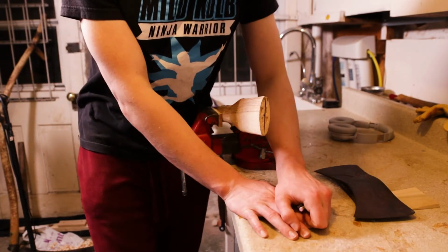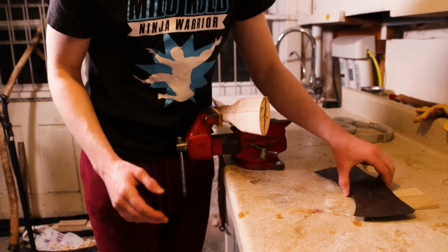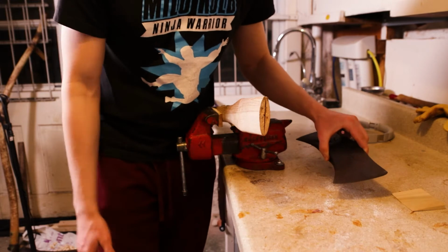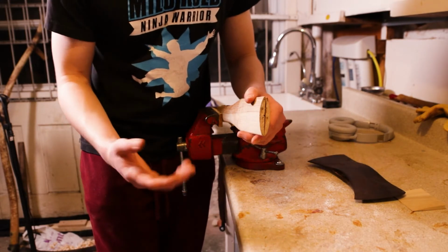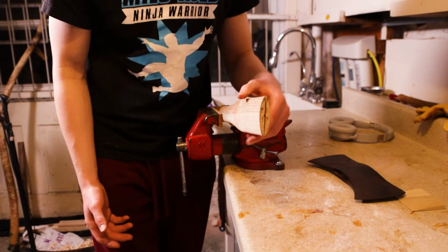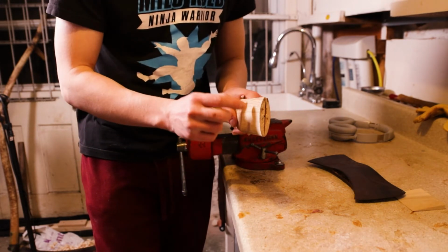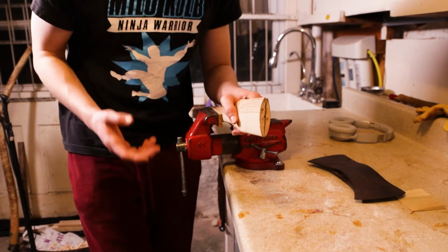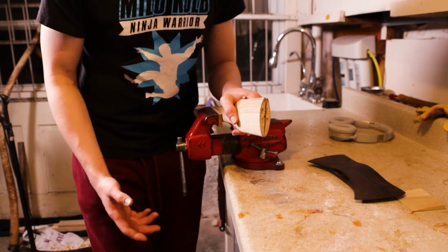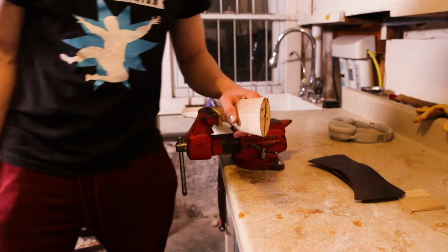And I usually recommend taking off a bit too much. You want to slide the axe onto the handle with your hand, and then you want to hammer it at the bottom, and just a few taps is going to work, and you just want it to seat correctly. Because the wedge takes up 2/3 of the eye, that's going to lock the axe in place really well. So you don't really need to have it fit perfectly until you actually seat it with the hammer.